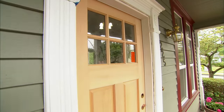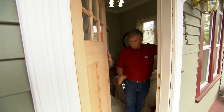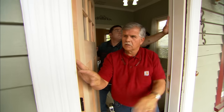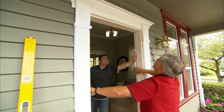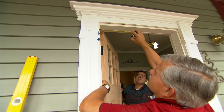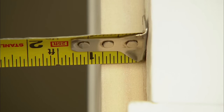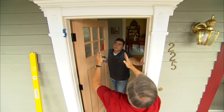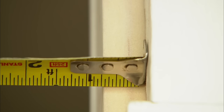Push your end in just a little bit — right into the opening, up against the casing outside. Let me open the door so I can go outside and make sure it's centered. Hold that door up so the whole unit doesn't fall in. I've got five-eighths on one side and a strong three-quarters on the other, so the whole jamb has to go to the right just a little bit.